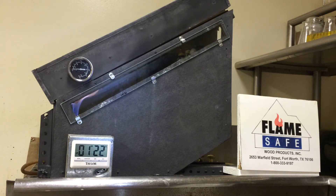The flame spread ratings based on the test method ASTM E84 have acquired a common acceptance by regulatory agencies. The ASTM D3806 test that we are conducting at this time can be correlated to the ASTM E84 rated fire retardant of a material. Results obtained by this test method are indicative of those obtained with the large scale specimen that is utilized in test method ASTM E84.